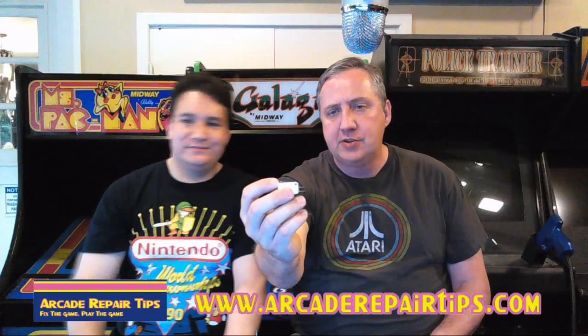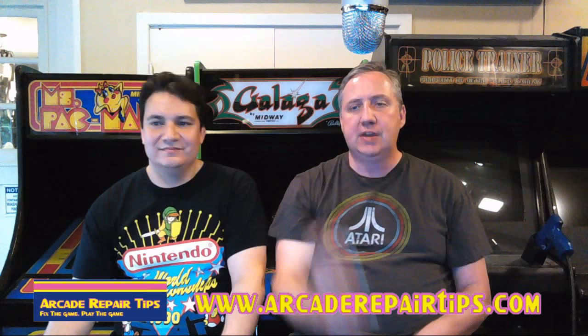Or the red part right there, the actuator, will just get worn, sometimes at an angle like this so that it's not hitting. Sometimes you can just flip it around and it'll hit better. But by that time, they're just a dollar or something. It's a good time to replace them. But we're going to talk about how to check this with a multimeter. So I'm going to show the outline here.